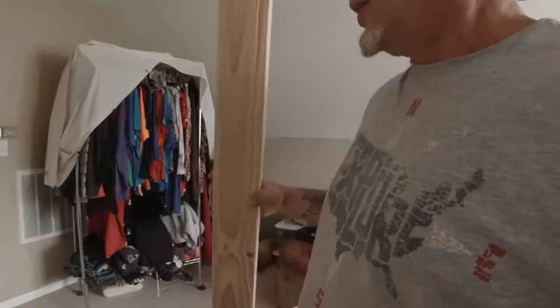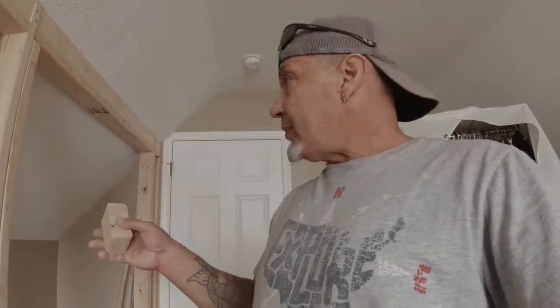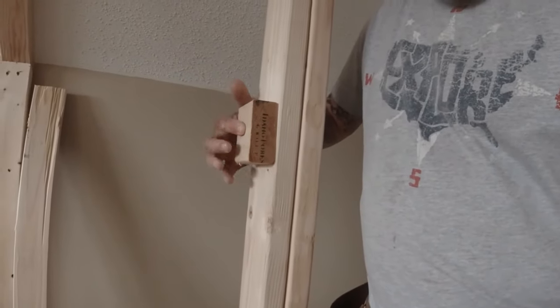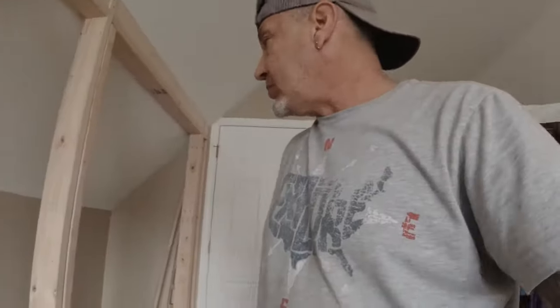And then anyway, I got two extra 2x4, so I'm gonna put one here and one there. It doesn't hurt. And maybe, just in case, we're not putting any light or anything in there, but sometimes I like to put about 4 feet high an extra block. So if they ever wanted to put a light in here, a light switch, there'll be a block in the wall, you know, and I'm going to block across that way for the shelf and pole.